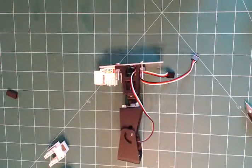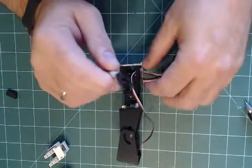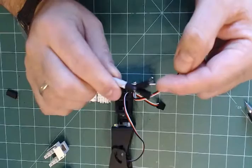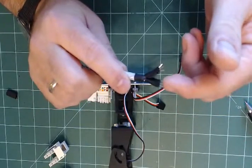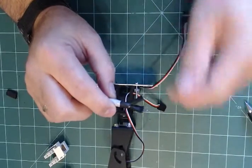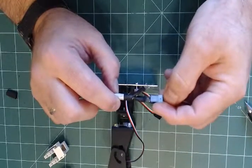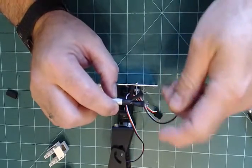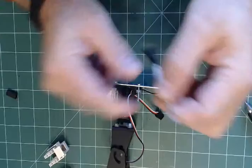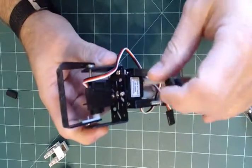I made a pigtail — here it is. I've already soldered the wires according to the schematic, one set for each servo. I don't know which is which until I plug them in; if X is running the wrong servo I just swap the wires. I've put heat shrink on them. I'll feed the pigtail up through the pan-and-tilt mechanism underneath, hold the nut with my fingers — it only needs to be snug since the unit is light — and tighten a quarter-20 bolt.